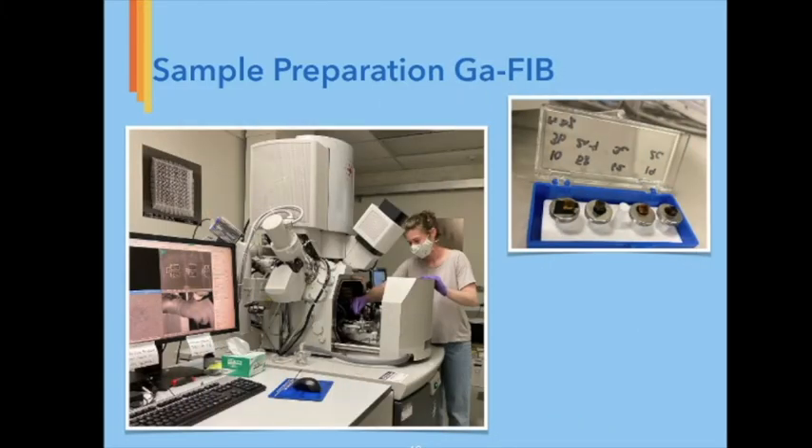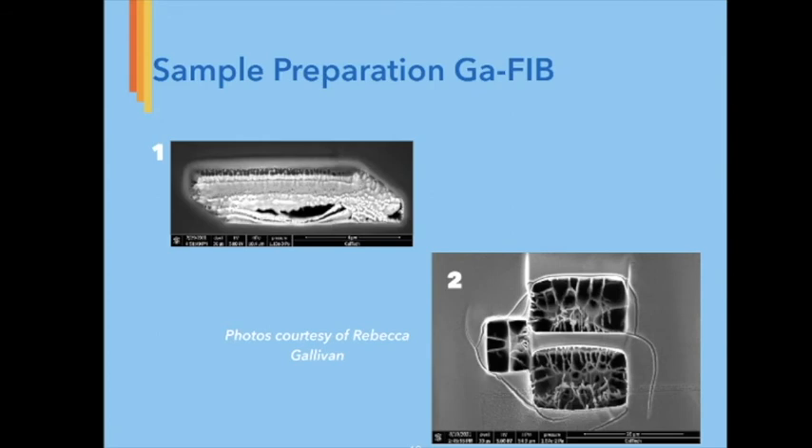The second method for preparing an electron transparent sample is to use FIB milling. This machine can utilize a combination of electrons and ions in order to etch material from a bulk sample. Pictured on the right are different concentrations of the Greer Lab's iron and chromium metal polymers mounted on two milling stages. Normally, the FIB lift-out process utilizes the deposition of platinum to protect a sample. However, when attempting to deposit a rectangle of platinum, the sample degraded significantly. This led us to forgo the depositing of platinum onto our sample in order to maintain sample quality.